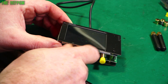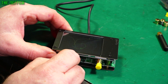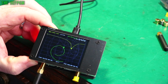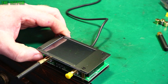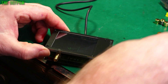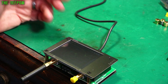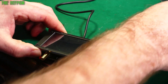Let's look at the next one. When screwing it on, spin the nut not the antenna - otherwise you'll wear out the centre pin. Another antenna. This one's looking slightly higher in frequency - it's about 820 MHz. Laying it off the edge of the desk, it goes a bit higher - about 826 MHz. So that's about 20 MHz higher than the other antenna. Trying the third one off the edge of the desk - that's similar to the last one. So they're definitely not 868 - they're more like 810 to 820 MHz.